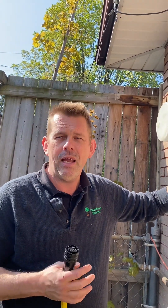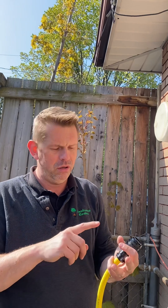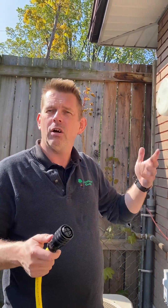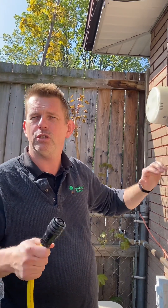When the generator is plugged in and you exceed 30 amps, either the generator breaker will trip or this unit will trip. In either case, come out, shut the generator breaker off, and shut off some of the things you were using inside — like if the air conditioner came on accidentally. Go in, turn off the big things: air conditioner, dryer, oven. Come back out, turn the things back on, and it should reset itself — there's no button to press, it just resets itself once the current is back down.